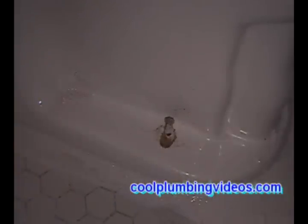See, we take the sponge and the water, and we start flushing the excess away and wiping it up in the sponge. Then we just continuously rinse the sponge out back and forth until we get to the point where we get our nice smooth finish. Now, each time we come back with the sponge, we start using less and less water, until close to the last wipe, we want the sponge kind of dry so we can wipe up the film and the excess plaster of Paris around the toilet.